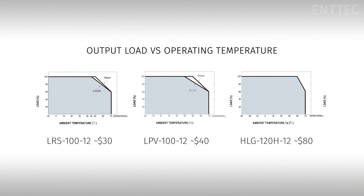An essential piece of information to consider when choosing any power supply is the derating curve. This is a graph that shows how the output of a power supply will drop as the ambient temperature increases. Generally speaking, power supplies will drop their maximum output as the ambient temperature reaches a certain point. This is considered a safety feature, because if a power supply continues to output at maximum power in a very hot scenario, there is a high risk of electrical fault or fire.